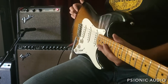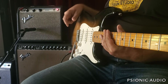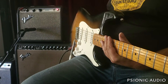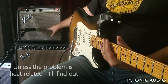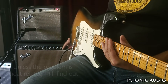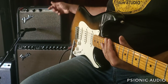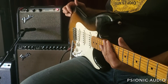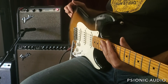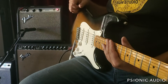Well, not done, are we — but all the other issues this amp had are gone, and now I just have to find what's causing that. The issue with this kind of thing is if I test with an external speaker, the problem will go away, which could lead you to think it's the speaker. It's actually the fact that the speaker is connected to the box and the whole thing vibrates — go to an external speaker and it doesn't vibrate the same degree, the problem goes away and you chase your tail. I'm going to go have another cup of coffee and dive back into this thing. Aside from that remaining nastiness, the amp is overall sounding great and everything I've done has been getting along the path towards goodness.